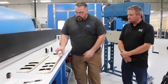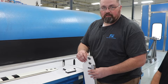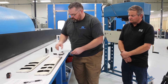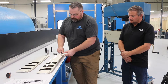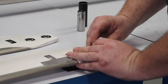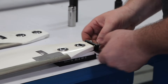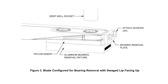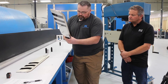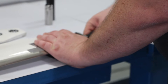Now for the tool — before I install it, I'm going to make sure that there isn't any excessive sealant on the end here so that the holes line up properly when you press out your bearings. Installing the tool — both sides are staked, so I'm not too worried about scraping the insides of the sleeves where the bushings seat into. You want to make sure it's together, seated properly, and snug.